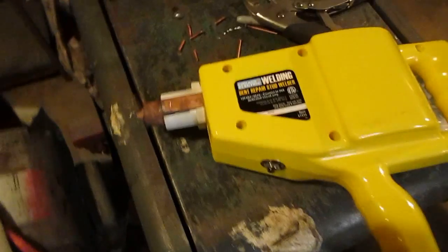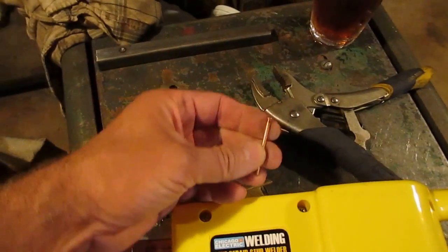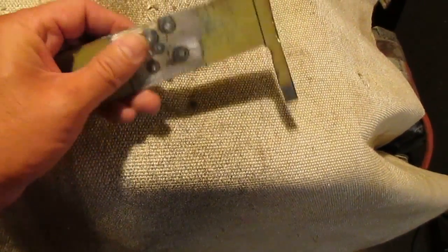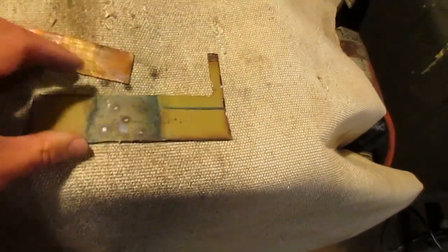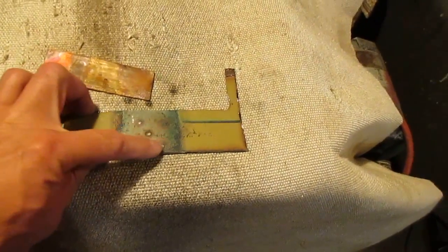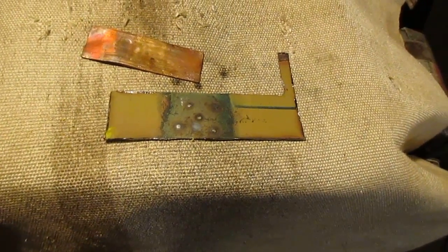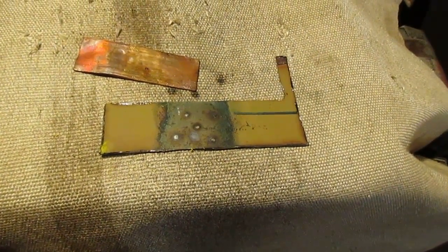It's meant really to put these bigger studs on, and those are really meant to go on very thin sheet metal, and this metal from the truck is probably about 1.5 to 2 times thicker. The other thing I noticed is it's leaving lumps, and I really don't want to have to dolly all these lumps out of the hood. So I guess I'm stuck with the fact that I'm going to have to TIG weld all those little studs onto the hood.